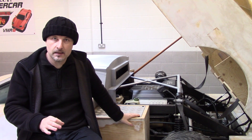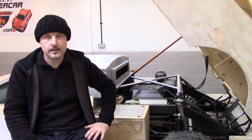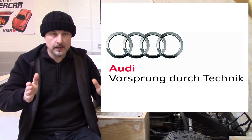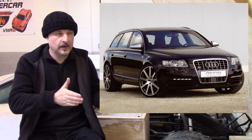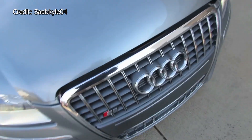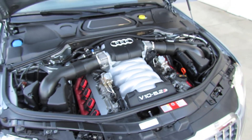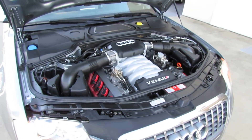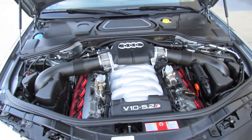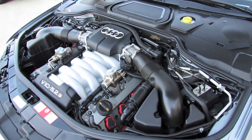When I started designing this car back in the early 2000s, I had no idea that Audi was going to put basically a Lamborghini V10 into a family saloon and a state car. The Audi S8 is powered by a Lamborghini-derived 5.2-liter dual-overhead cam V10, 40-valve with variable valve timing, producing 450 horsepower at 7,000 RPM and 398 foot-pounds of torque at 3,500 RPM.